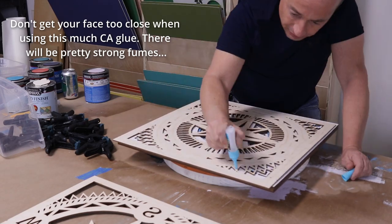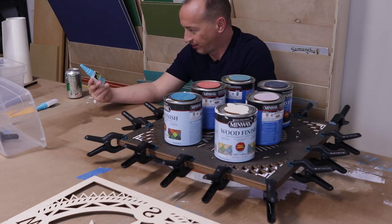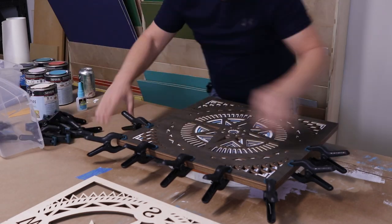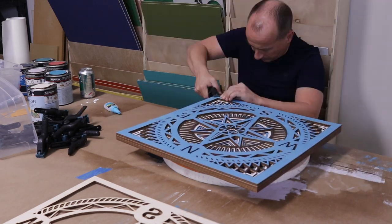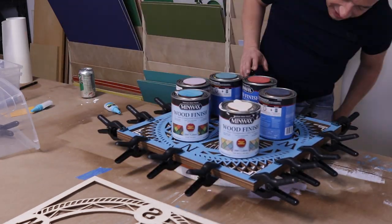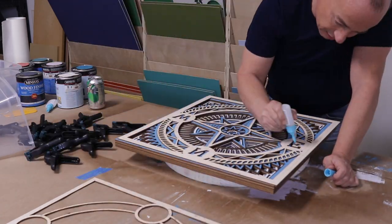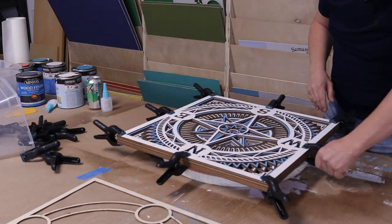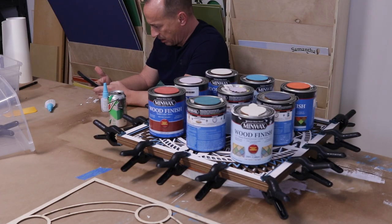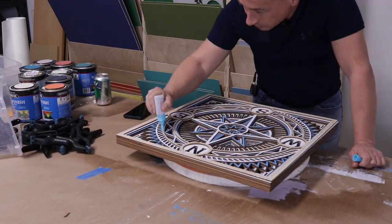I don't use regular wood glue - I'm going to try a few other adhesives soon because with these big layers, regular glue takes too long to set up. With nine layers glued together, I was able to knock this out in probably 20 or 30 minutes of actually messing around - clamping, letting it set for two or three minutes with weight on it, then moving on to the next piece. Rinse and repeat. It actually wasn't that bad. I had a friend over, yammering in between everything.